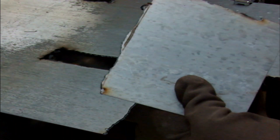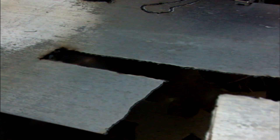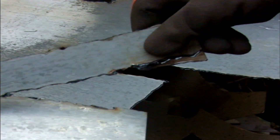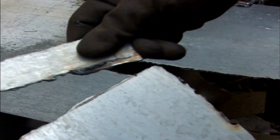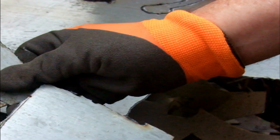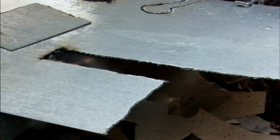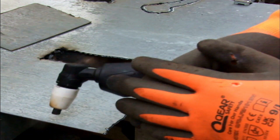Okay it's not a straight cut but it's so much tidier. When you look at the other stuff I did, I've got that on 30 amps instead of 40 — you can see how messy that is versus how much tidier this is. I wonder what would happen if we turned it down to 20 amps — let's give it a go. Actually, 25 amps — I'll just freehand it.